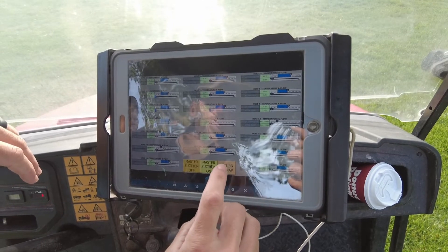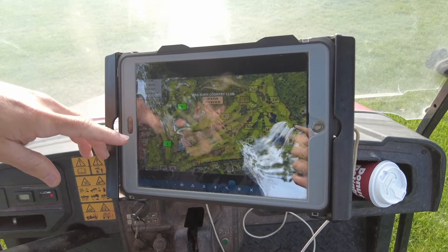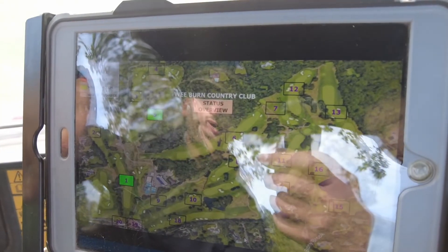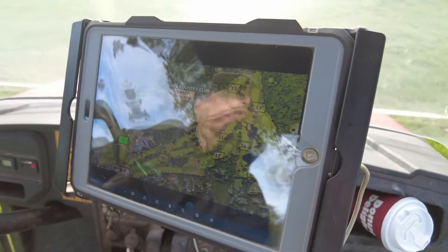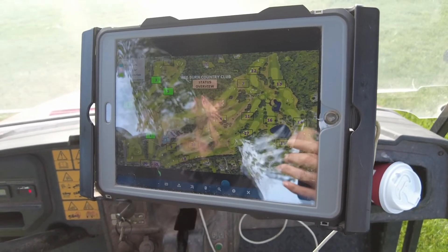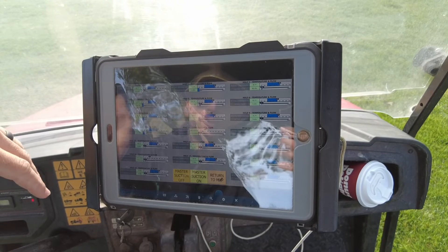So now you can return to the map to see it working. It turns on each unit — the first unit is unit one and five, which is a unit that shares two greens, so one and five turn on at the same time. It's on a time delay — I think it's 15 seconds — then each unit turns on in order. Number two is on, next to go would be three, and it just goes in order from there. We also have a master suction off button which allows you to turn off every single unit at the same time. I'll turn master suction off now and if I go back to the map they should all be transparent again to show they're off — yep, there they go.